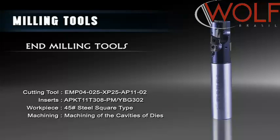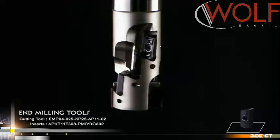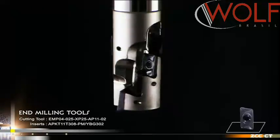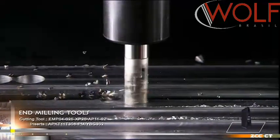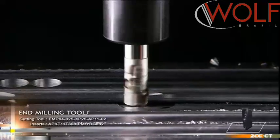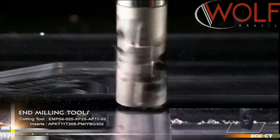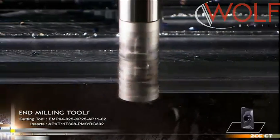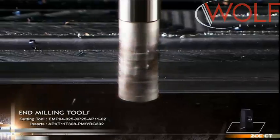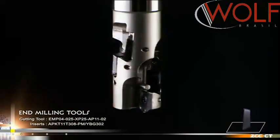EMP-04 series of milling tools. EMP-04 series of helix end mills with a long cutting edge can obtain a considerable cutting depth. The inserts are mounted in a spiral line with increased cutting edges in machining, a stable cutting force, and a free flow of chippings. The long edge tools can machine with the side edges with good end milling results, and are widely used for rough and semi-finishing machining in various industries.